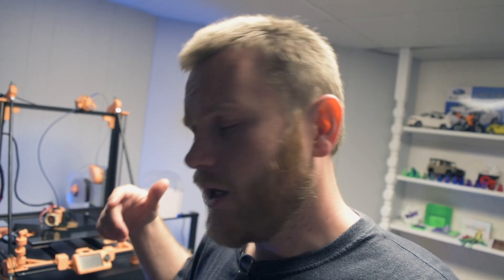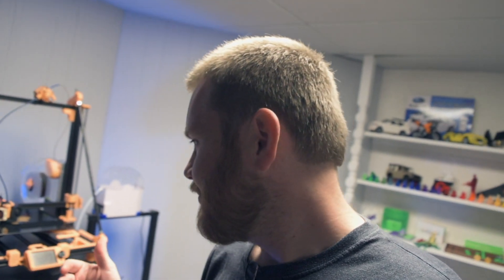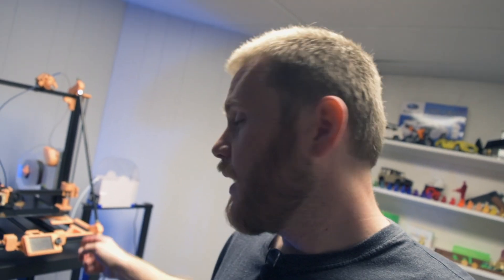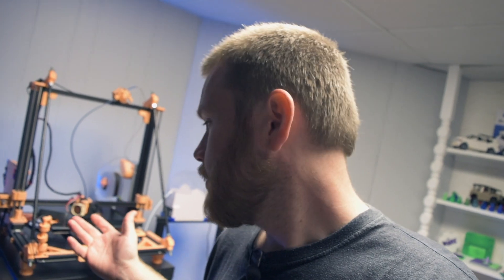I tried to dry it. I tried every single temperature possible between 180 and 240. I tried different bed temperatures - everything short of changing any hardware on the Aquila. So at least I now know that the filament just likes a larger nozzle, which is typical with this type of filament. I'm not giving up on wood just yet - I think I can order a different roll from a different brand in hopes that it has a smaller wood grain in it so it's not just going to get jammed. I'll see you in a day or two.